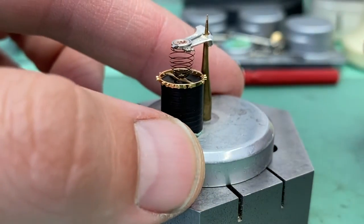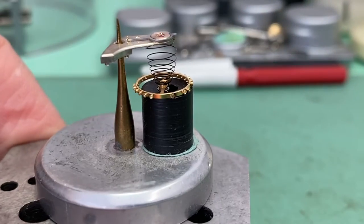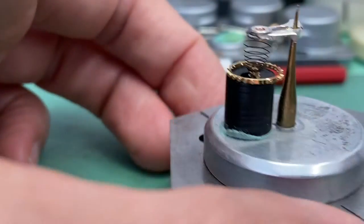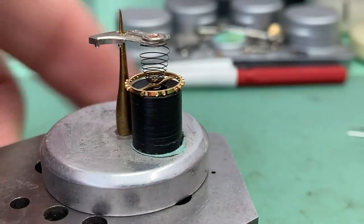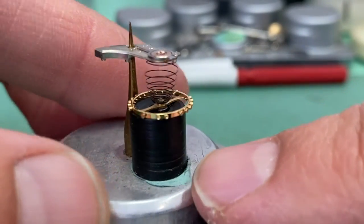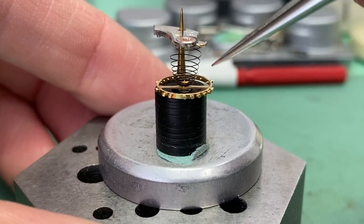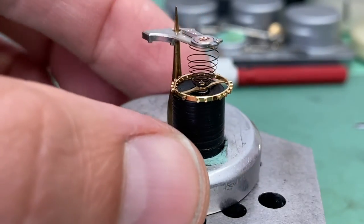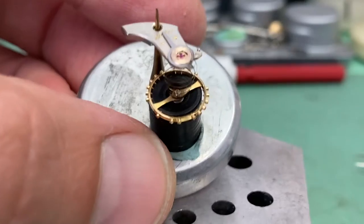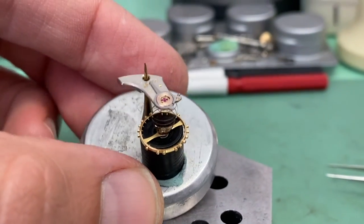Some of these old watches, the hairspring is super large and dangles — stretches out a lot, moves around. So I put this little plastic piece down here that I made, stuck it there with Rodico, so you can move it. I get it centered right under there. I put the balance bridge screw in that hole, and that hole also accommodates the roller jewel. The balance wheel rim just sits on top of that Delrin plastic piece.